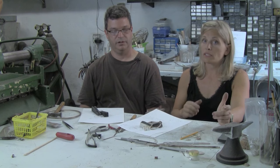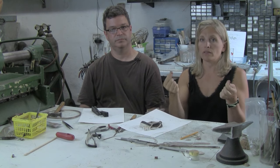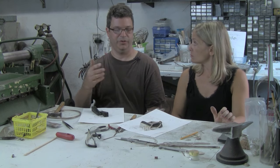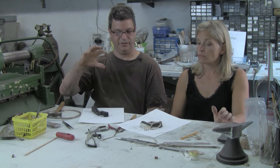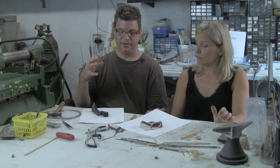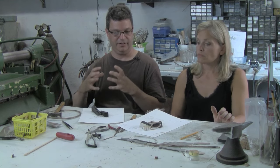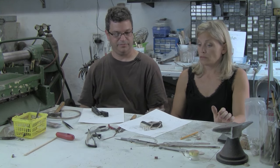I definitely try to give the illusion of a lot of metal without really laying it in there, because we can back things, we can give nice heavy edges — take some wire and rim something so the edge feels nice and beefy and not thin — but you can get away with a much thinner sheet than 18 gauge. We talked about the importance of looking at it from a distance and up close, and the drawings are drawn to be graphically impactful, and the way you're constructing them out of elements they have a presence and a heft that is important.